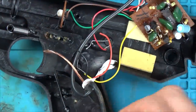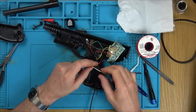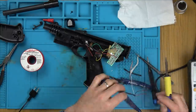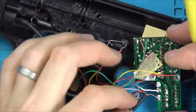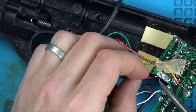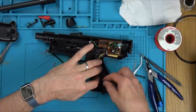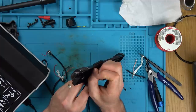That was nice and easy to find purely because I could see stripped wire where it went into the gun. They always go where you have a heavy piece against a light wire — whether it's headphones, a gun, or a controller. So it's nice and easy to fix: plenty of spare wire on this, so all I'm doing is chopping out the bad four inches or so and soldering up some new wire. I'll make sure to wrap it around the cable tie part to give it strength so it can't pull straight out of the gun. I held it up to the camera thinking if it was like tin can alley you should be able to see a light, but I thought it might be infrared — like a remote control — and hoped the camera might pick it up. But I couldn't see it on anything. We did find the fault though.